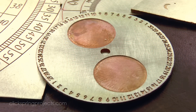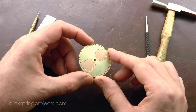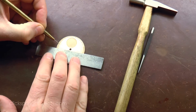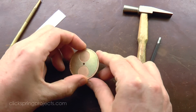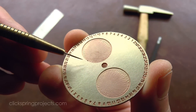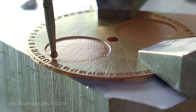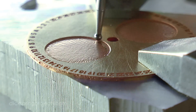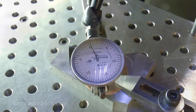Now for this particular project, at least one of the test pieces should be the lunar phase date disk, because with a quick modification it becomes a convenient marking template to position both the lunar phase display window and the date window. The date window position is punch marked between day 29 and 30 on the disk perimeter. The phase display window position comes from drawing a line from that point to the opposite day 23 position, and marking the furthest point where it intersects the intervening circle. That circle is not a precise reference, but it's good enough to drop a relatively well centred hole within its boundary.